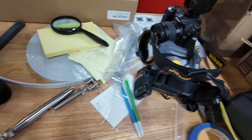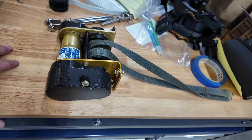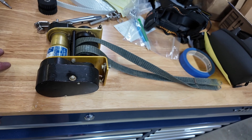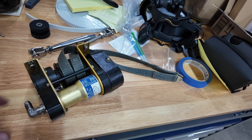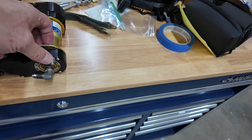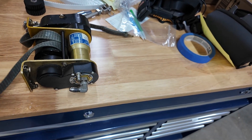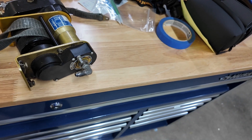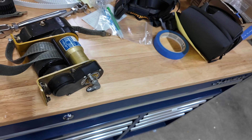Let's talk about the inertia reel. This poor thing — there is something wrong with it. I don't know if it's because it's been fired and in that process damaged something. The issue is that while I can retract the reels, they will not release via this little mechanism here. The handle that connects to this allows the inertia reels to release so you can lean forward a little bit. This is actually the gas connection that's connected to the pyro for the seat — when you pull the handles, hot gas flows through this thing and spools it up, pulling you tightly against the back of the seat before the main mortar fires.